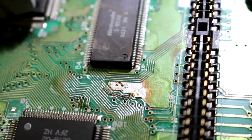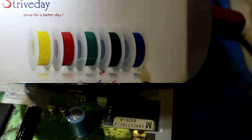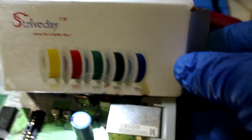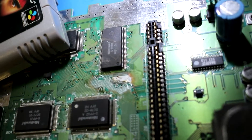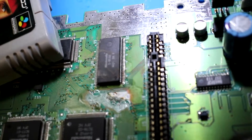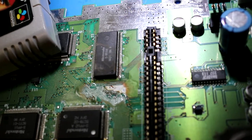So that has been repaired. I took some wire — I think this is 30 gauge wire. I basically just cut the wire open, pulled out some strands, and repaired each trace with a strand. It was two traces that needed work. We will take a look at that underneath the microscope now.